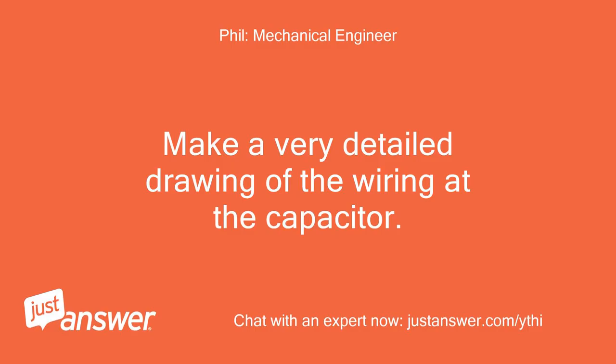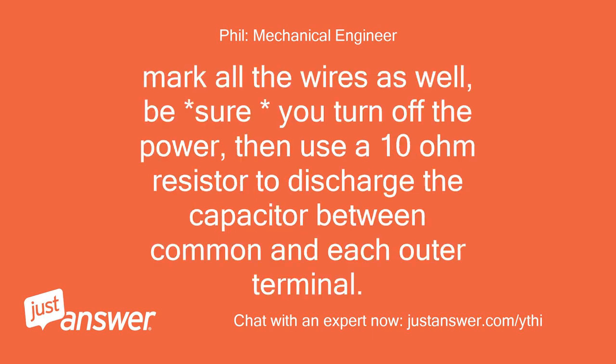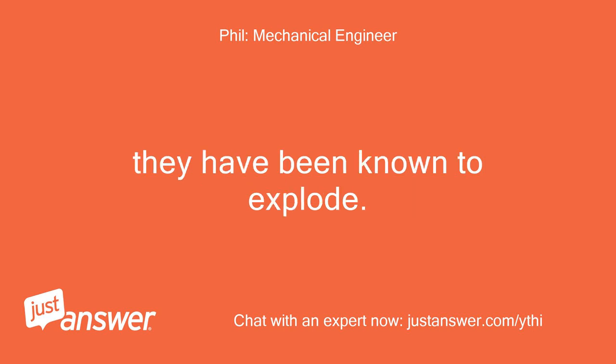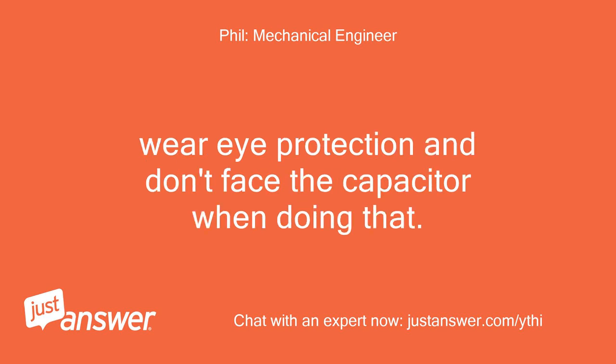Make a very detailed drawing of the wiring at the capacitor. Mark all the wires as well. Be sure you turn off the power, then use a 10 ohm resistor to discharge the capacitor between common and each outer terminal. Some people just short it with a screwdriver. They have been known to explode. Wear eye protection and don't face the capacitor when doing that.